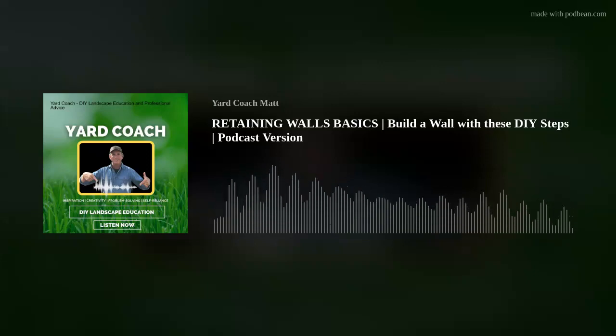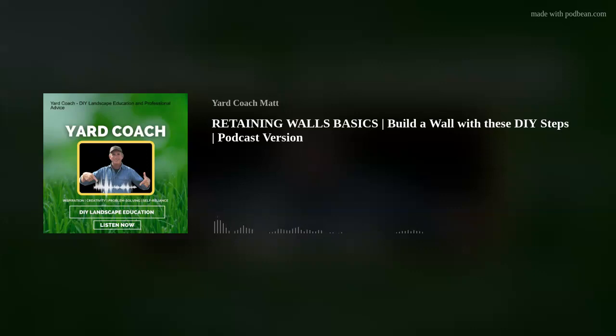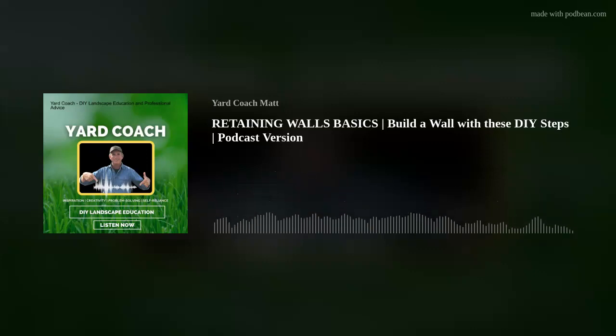And this is where you are going to dig your trench back into the hillside. You are going to dig it out and you are going to form it up. An initial pour is going to have a key in it. And that is generally going to be, I would say, at the minimum, a 4x4 type of key. And once you get that and you've poured it and it's perfectly level, now we're going to form the vertical sides of your wall to whatever height.